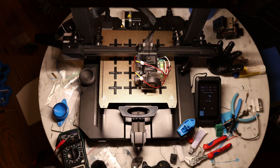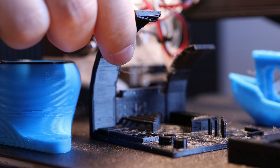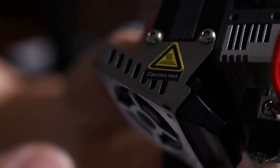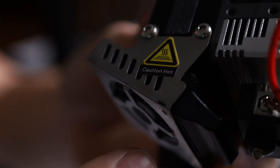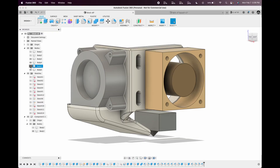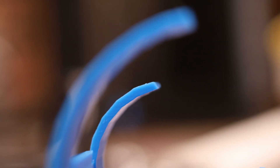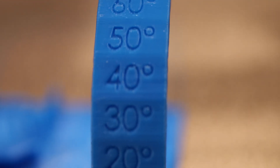If you have experience with the S1 Pro, let me know in the comments if you've seen this stringing too. Also, the overhang performance is good but not great, and that comes down to the tiny part cooling fan on this machine. I've designed a bunch of fan ducts that you can bolt onto the side of this machine to greatly increase the part cooling capabilities — head over to my Patreon where I've just dropped a bunch of new files and fan ducts that are super easy to install.